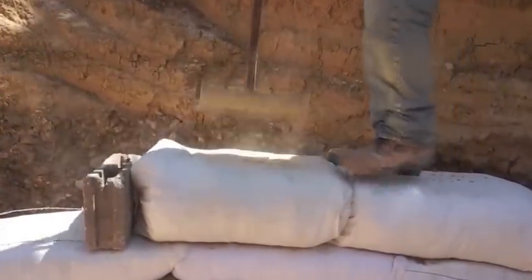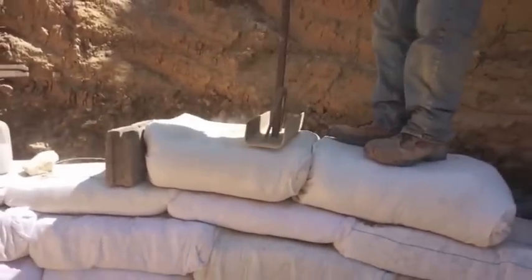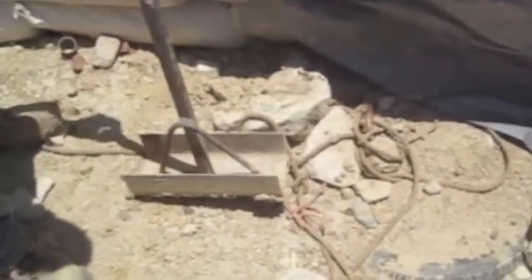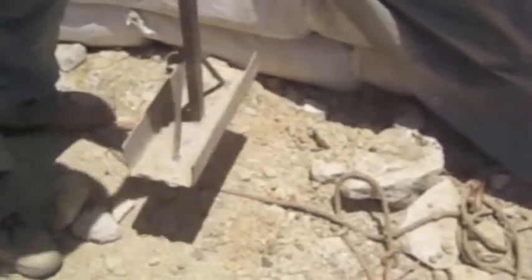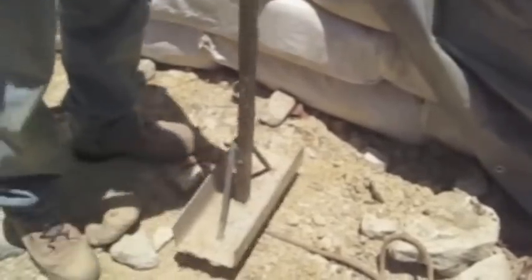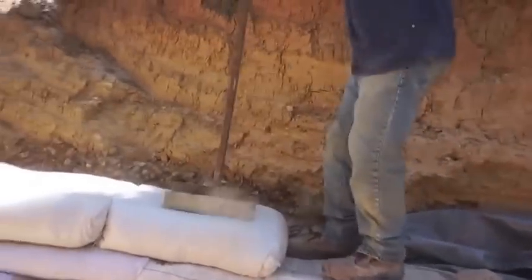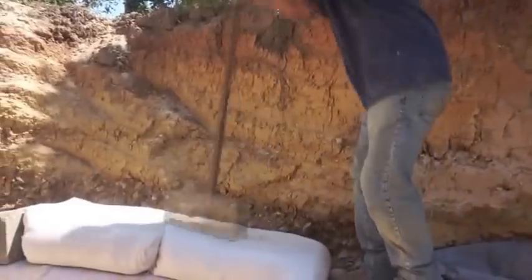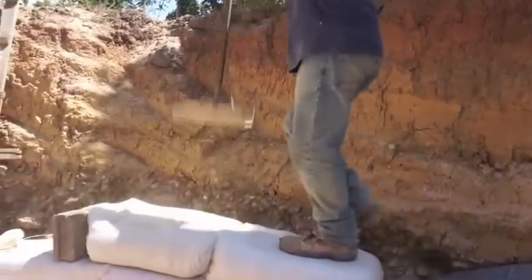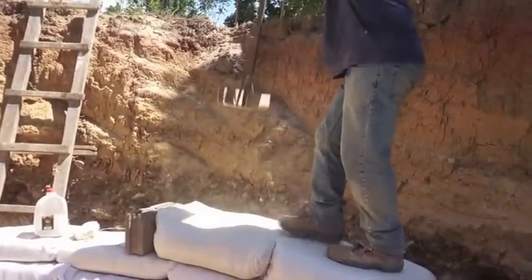This is what I really like about this tamper — it's so easy to use and there's no kickback. We got a special one made. This is the best rammer I've seen. I tried the one sold in the hardware store, but we made this one with a piece of channel iron. The square one seems to bounce and hurts your wrists, but this one you can actually control. It's so easy to go.